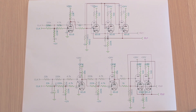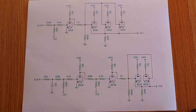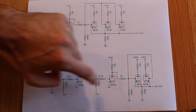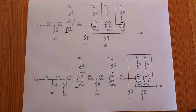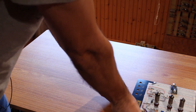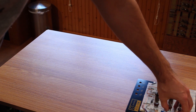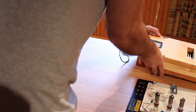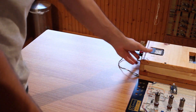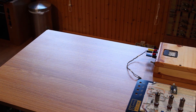I think it's time to give this a test on the breadboard. We don't need to build the buffers on the breadboard — the breadboard version is just going to be showing us some signals. We're only going to really need three tubes to put onto the breadboard to test out, and I want to see what our delay looks like. The delay is going to be very, very short and there's not a good visual way to see that — unless, of course, you have an oscilloscope. So let's get the oscilloscope out.